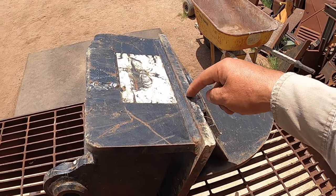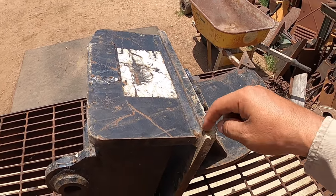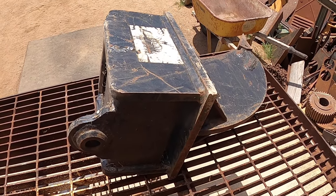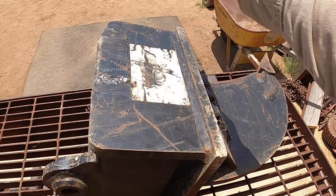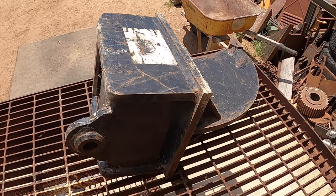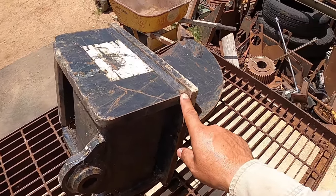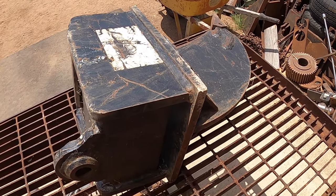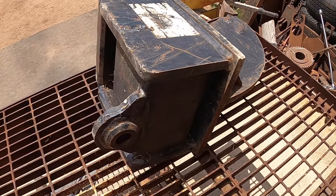So as we see here, it's just one simple hot pass, one big hot weld on there all the way around. So in a very similar sense, it'll be one pass of arc gouging to remove it. You can cut it off good enough that you can reuse this and then add on to this as necessary for the different attachment.